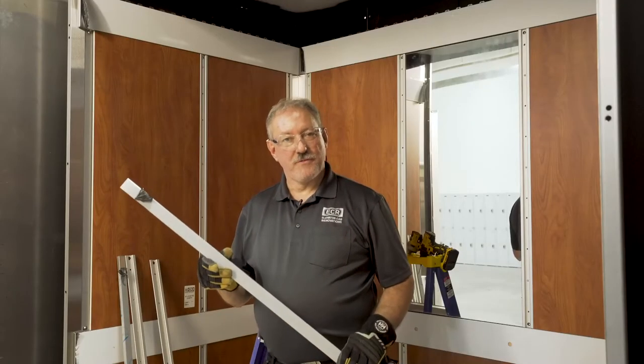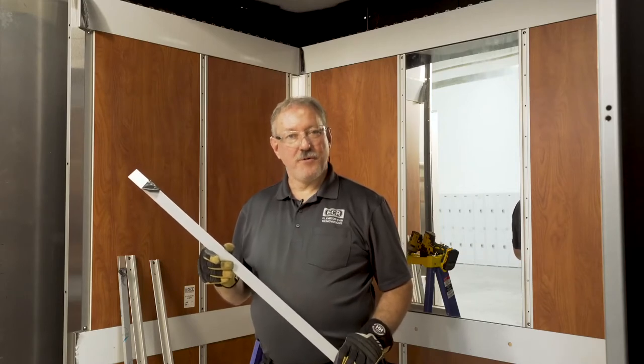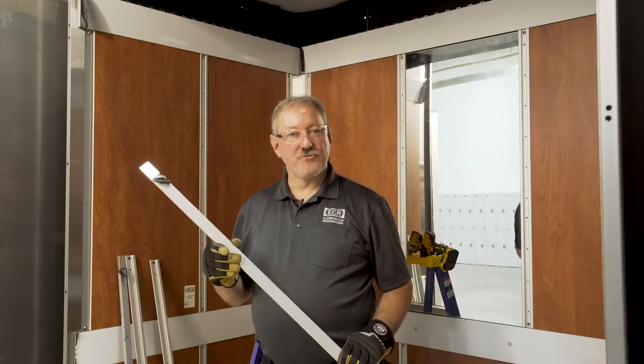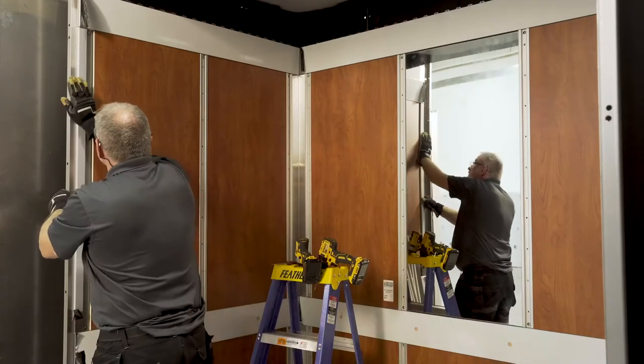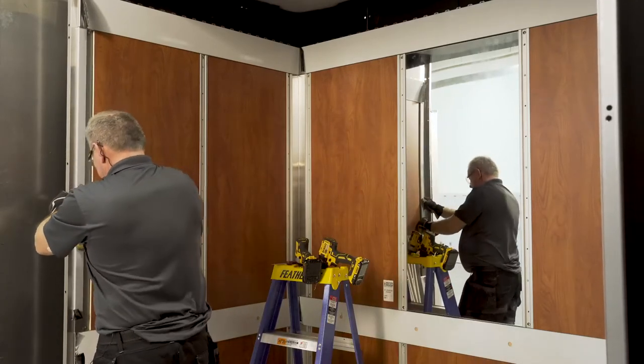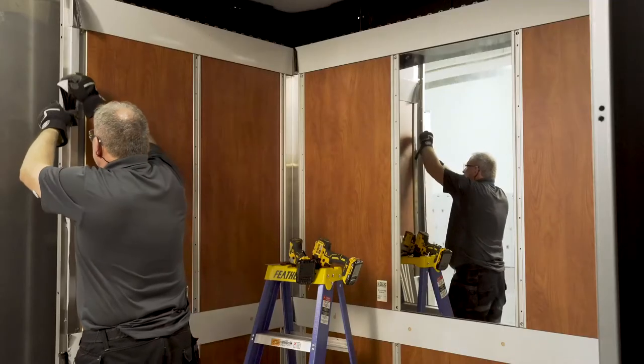This is the raised front reveal. It goes along the leading edge of the panels and its purpose is to put the extrusion on the same level as the panels themselves. All you do is line it up with the notches like everything else in this system, and now because we're going to put the extrusion on, we're going to peel off the plastic protective film.